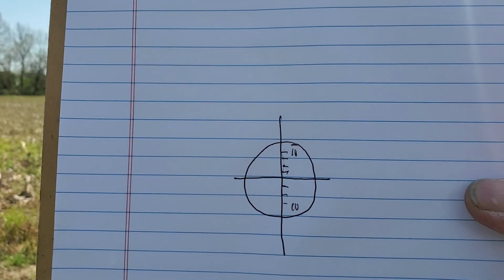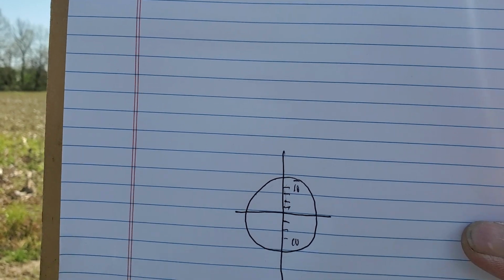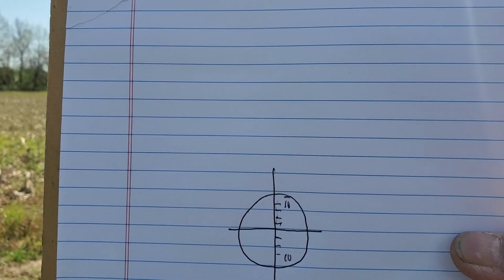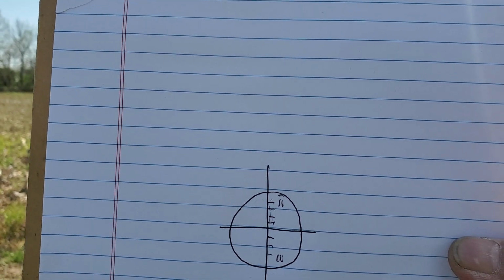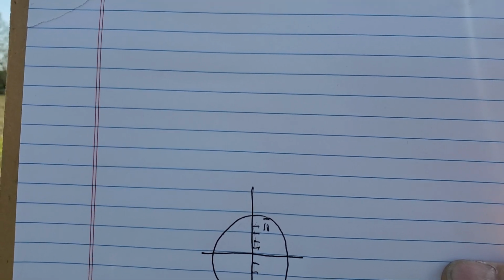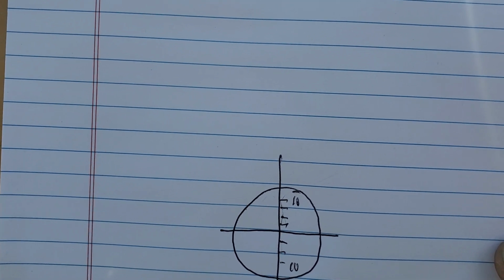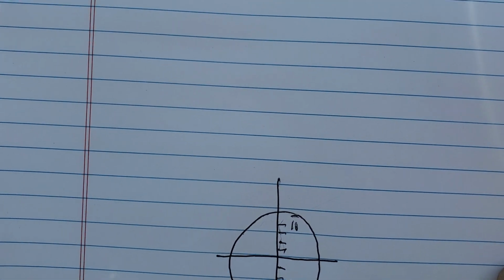Now this isn't exact, but that's what you kind of see in the eyeball. You've got the crosshairs. Your horizontal line is what you're lining up with the top of each stake. As you do that, that dial's going to go up and down. I don't know if you can see those numbers there to the right, and you read them off. Each one of those is a % slope. It was just below the first line, so it was about 1/2% slope on this hill.